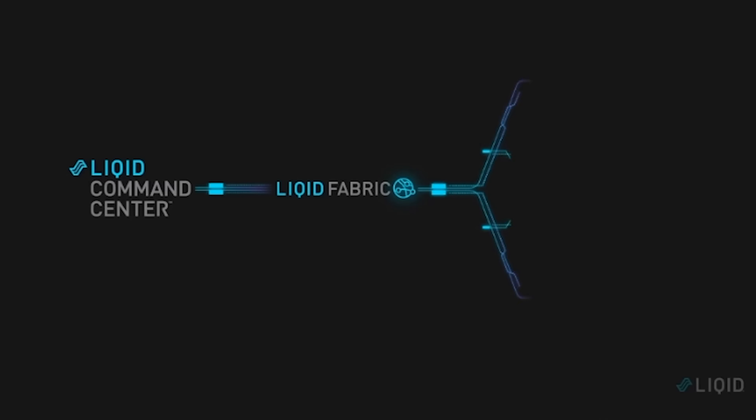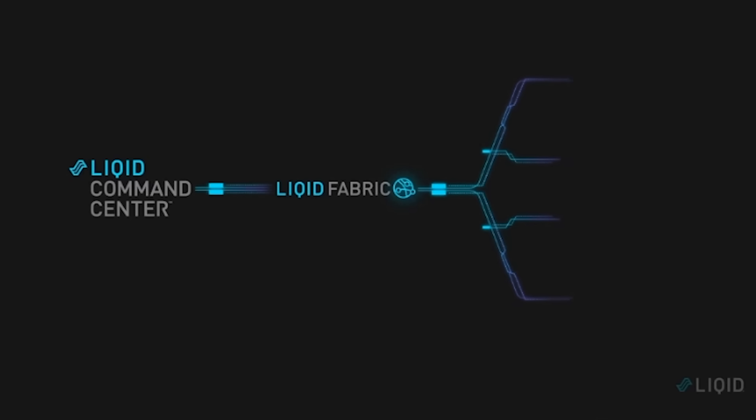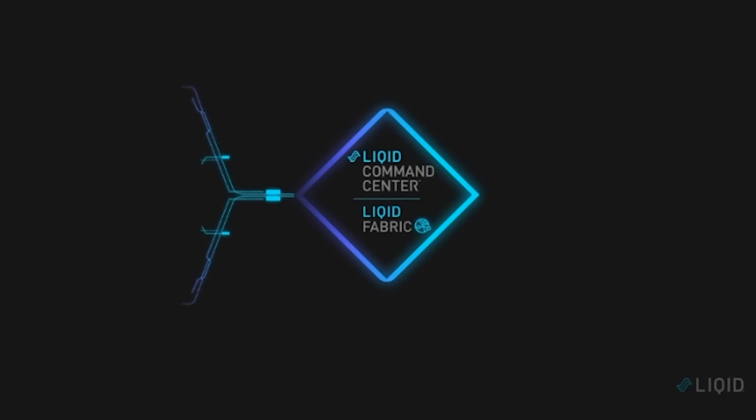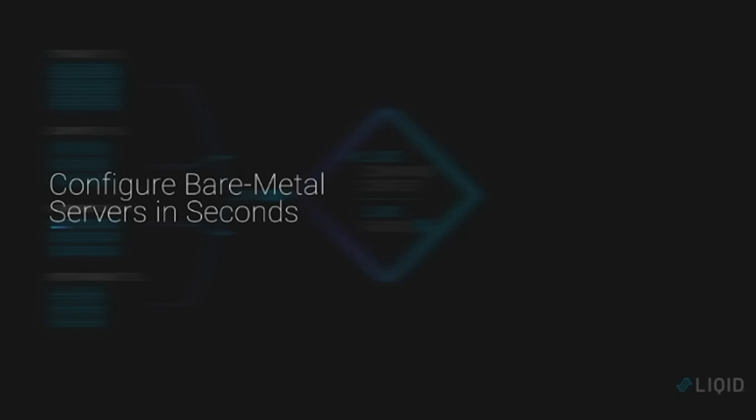I did another video about PCI Express because changes at the top and bottom of the industry are coming. At the top, in servers and interconnects, when you've got a pool of servers to connect together, Ethernet is not always ideal. Ethernet has its place, but when you're connecting high-performance servers in the same rack — sharing storage and compute resources like GPUs — PCI Express makes a lot more sense. In the past it's been things like InfiniBand and other exotic solutions, but now just PCI Express makes sense.